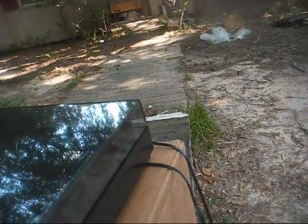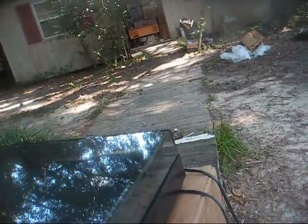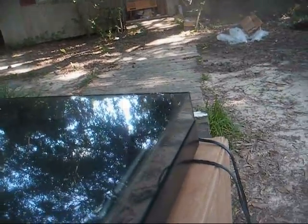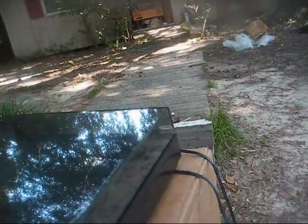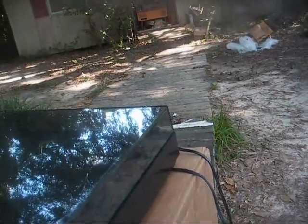And then you need, I'm using a 120 volt neon lamp attached to an AC power cord, because this lamp will flicker at 60 cycles per second, which is what this strobe is calibrated for. And what we'll do, we'll place the strobe on the turntable, and then we'll need to raise the tone arm so the needle doesn't contact the platter, and move the tone arm over so the turntable starts.